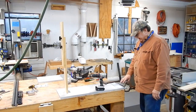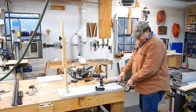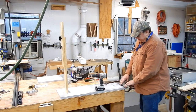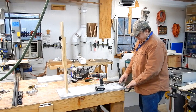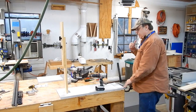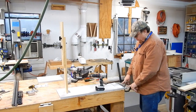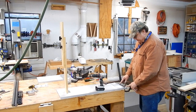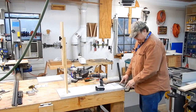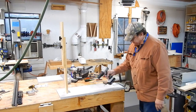This inside edge of the plate — being that you have the leveling screws right here — ends up raising it up out of the groove a little bit. Need to make sure we have enough groove to hold this plate from sliding back. This is the entry plate. I'm adding some quarter-inch stock here, raising it up so that it will catch that lip. I'll just cut this piece off at the end, and I'm installing them with roll pins — drill it, pin it.